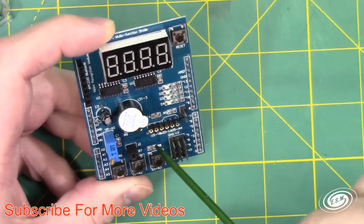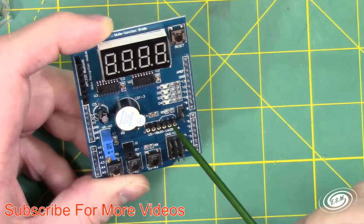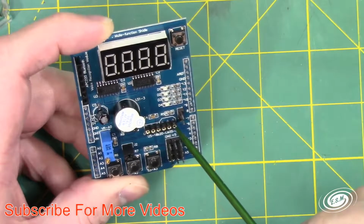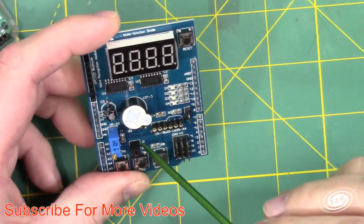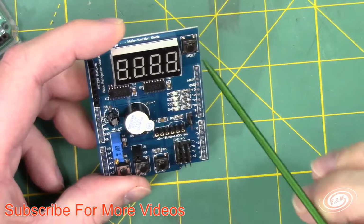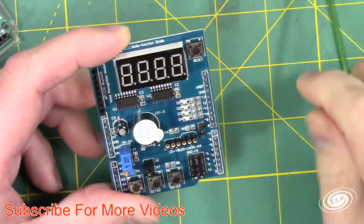And then we have this weird system here. This looks like it's for an LM35, MOSFET maybe, or a voltage regulator, because this last one comes off of pin A4, and it appears that one of these pins is positive and one is ground if you follow the traces from it. It appears to be ground and positive, but we'll test that with the meter here in a bit. And the reset button, and that's about everything on there. There's no I2C breakout that I can see. And the jumpers, again, I'm not sure what they do.